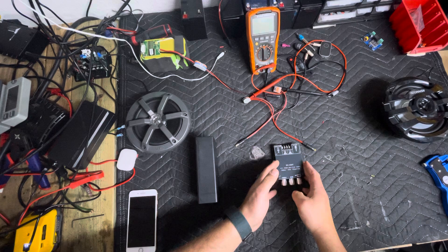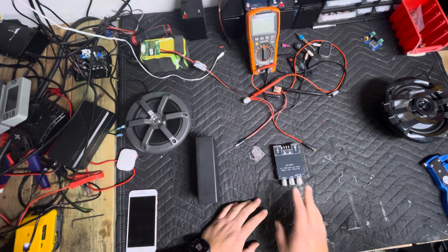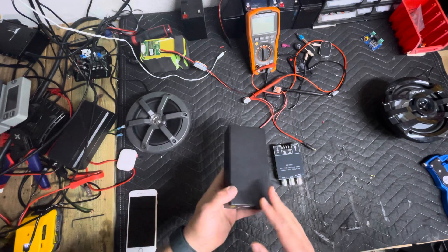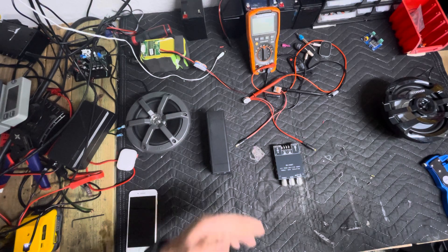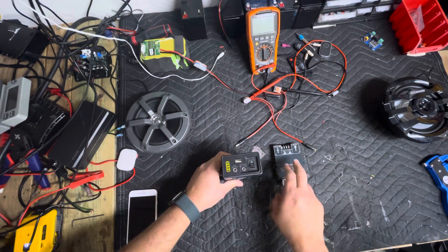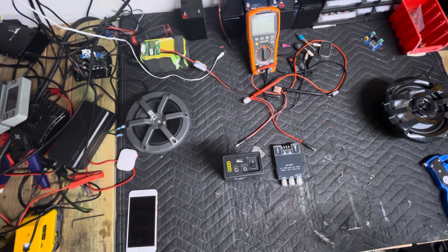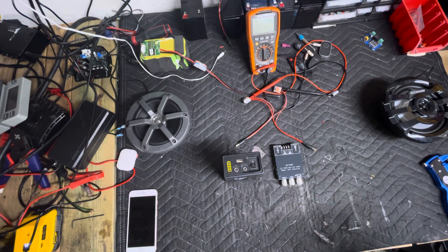This is the brand new ZK-1002T with the IPEX antenna connection on it. Some of the internals have been updated, so we're going to see if it can handle the higher voltage of the Talent Cell without a buck converter. That was an issue when we first started — at full charge you get over 29 volts and this amp does not like it. We're going to hook this amplifier up to a speaker and see if it cuts out like it used to.